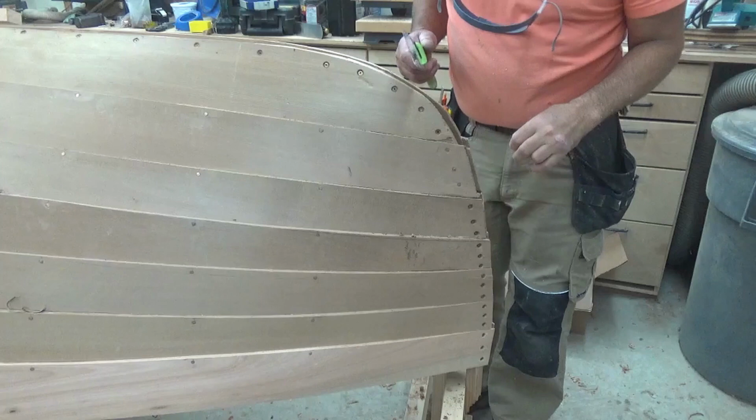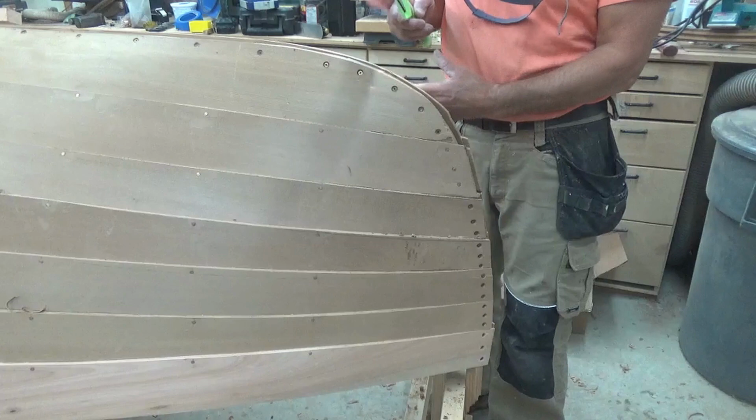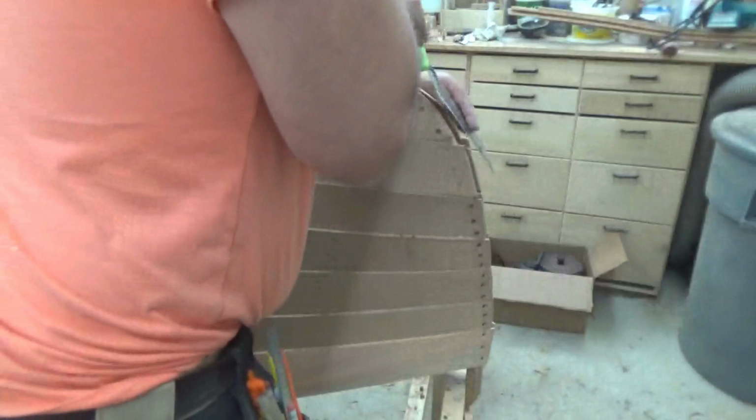That's going to take a considerable amount of time. I think I might be able to cut some of this out. The only reason I don't really like doing this is that the pull saw is fine if you're cutting this side and pulling in, but when you're pulling out this side, you tend to rip chunks of cedar out of there. So I'm going to try and be as careful as possible here. Maybe come from the other side here and get this large chunk of overhang off.